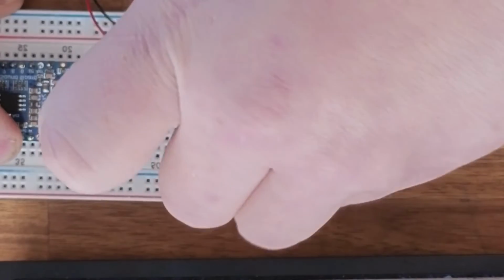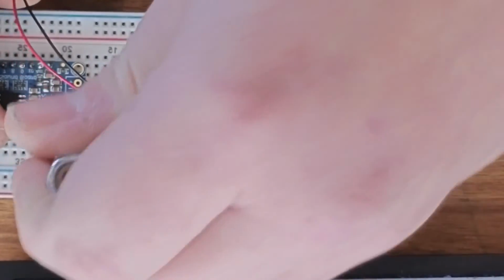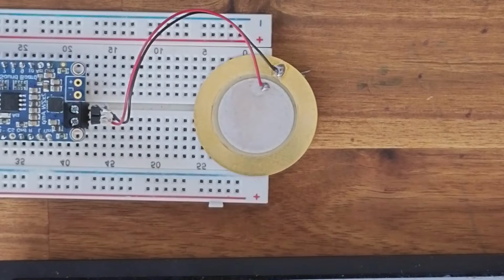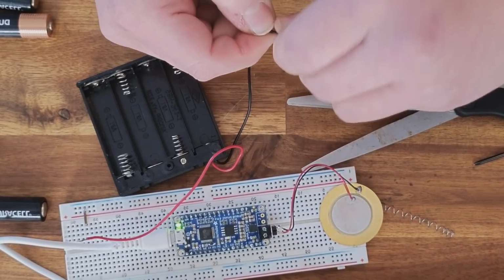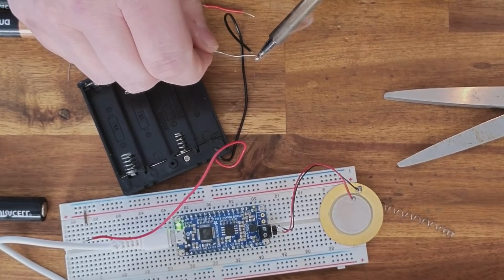Now that these 2 wires have the bigger ends from the pins, they're wide enough that those loose holders can actually screw them down. This thing I've been calling a speaker is actually like a 50-cent piezo mic. You can use it as a speaker. It's not a good one. You'll see later. In the meantime, the USB is not strong enough to power the speakers alone, so I do need the battery pack first.